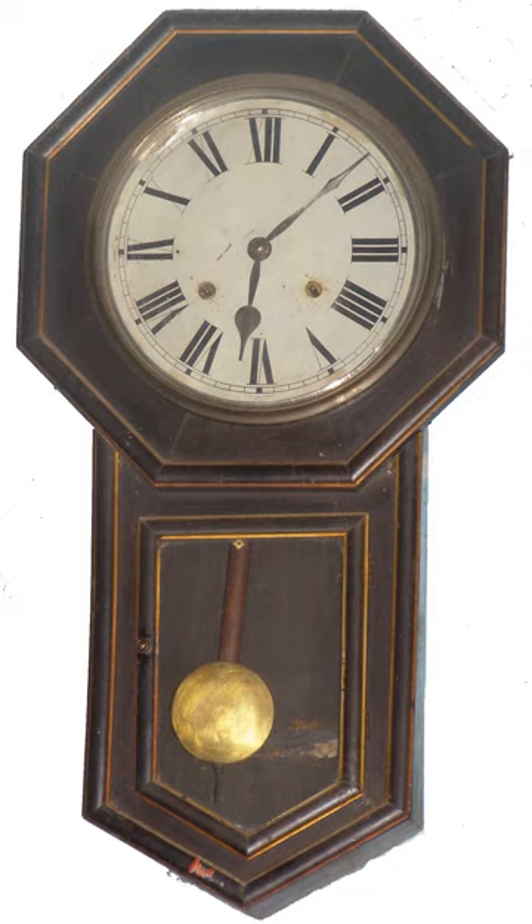The weight of the bob itself has little effect on the period of the pendulum. However, a heavier bob helps to keep the pendulum moving smoothly until it receives its next push from the clock's escapement mechanism. That increases the pendulum's Q factor, making the motion of the pendulum more independent of the escapement and the errors it introduces, leading to increased accuracy.